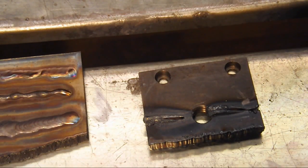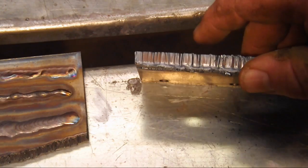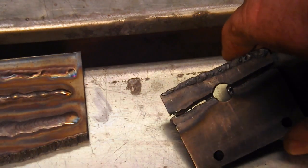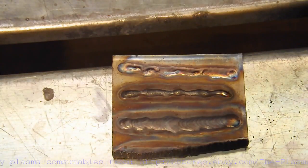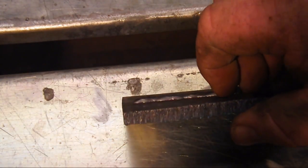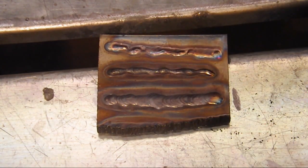There's a little wrap-up of our cutting testing. You can see the mild steel cut very nicely with the plasma cutter — I had to switch tips since the old one was going bad and it didn't cut all the way through on the first shot. Now here's the stainless steel. One thing you need to bear in mind with stainless is it's going to oxidize where you cut it with the plasma cutter, but that can be taken away with a flap disc or a little Scotch-Brite.